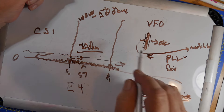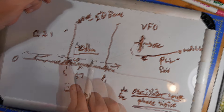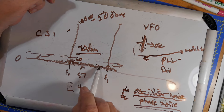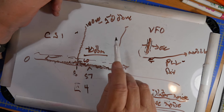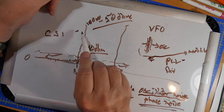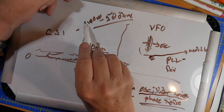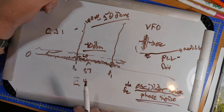If you've got radios on two different frequencies — like one on 40 and one on 20 — you'll get less of this because the phase noise tapers off as you get further away from the carrier. That means you could put a notch filter on the antenna: if this one is 40, put a notch filter that keeps it from transmitting on 20, and vice versa.